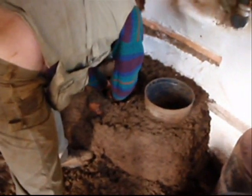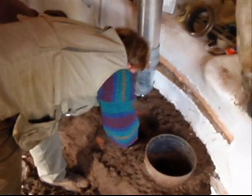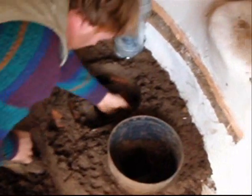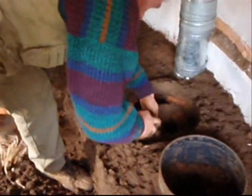The cob bench is all done and everything was pretty much complete. Then somebody pointed out that the barrel was an inch and a half too high. Apparently, the clearance between the inside heat chamber and the top of the barrel needs to be almost exactly an inch and a half in order to get really good and thorough combustion. So Ernie is reshaping the inside to make sure that what's flowing around the outside of the barrel can be properly channeled to go down inside that first bit of tube.